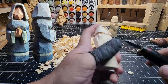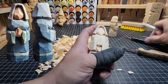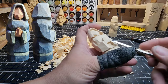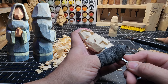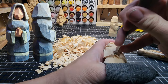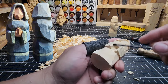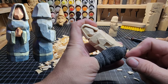Because it can make so much work easier when you've got the right tools for the right job. Like I was showing you the angled one, but this flat one can come in here rather than using a knife to do this, and you can just cut that section. You can smooth that section right there out along the bottom. I can come in up underneath this like that, and look at that, just pop it right out. So you don't have to do this with a knife. You can do this with a flat skew, even a smaller one like this, and then chip it out, and it just makes things a little bit easier if you've got the right tools. So some of you, if you bought a set and you've got a skew, use it like so, and you'll be quite happy with it. I just want to make sure I show that kind of thing, what all you can use these tools for.